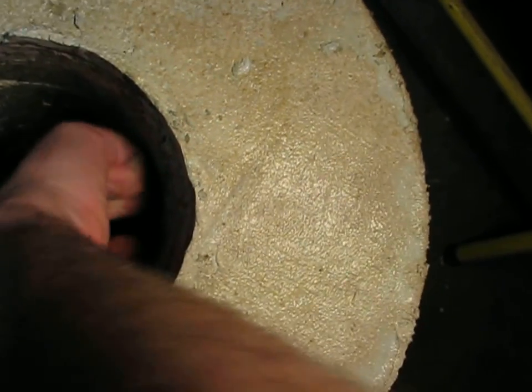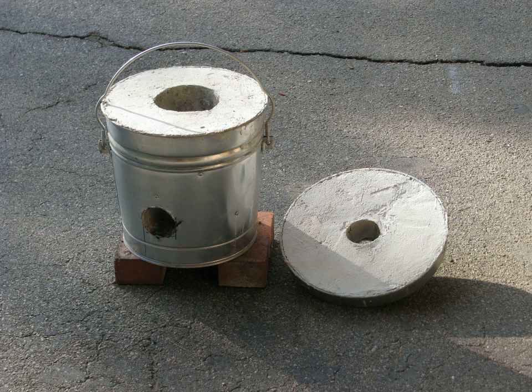Now the first major step of the foundry project is done. We need to wait a bit though, because we need to give all of this refractory time to cure. There are ways to speed up the curing process by building small fires in it and heating it in a controlled way, but the safest and best way is still air drying. So I'm going to put this aside for a month or two — I have plenty of other videos to show you in the meantime, and then when we come back we'll finish the foundry and start pouring some metal and working on our lathe. See you soon.